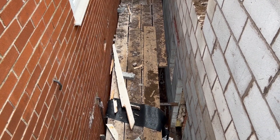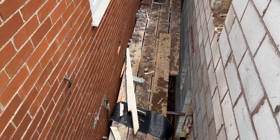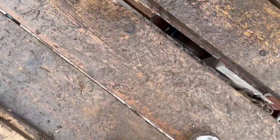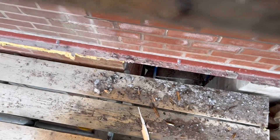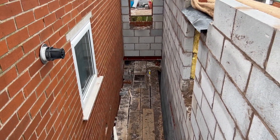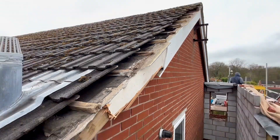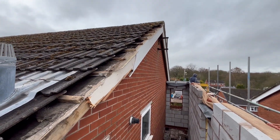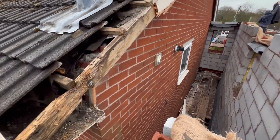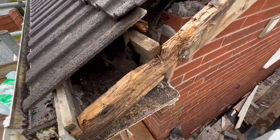We've got full protection in there with a small scaffold because we haven't been able to put the joists in due to that steel down there. That steel wasn't able to go in at first to carry the joists, so those joists can now go in. Next job is to get this roof on - we'll run a ridge through there, carry the wall plate through, got the wall plate on the front, and then extend the roof and build the gable end up.